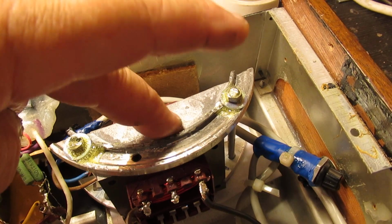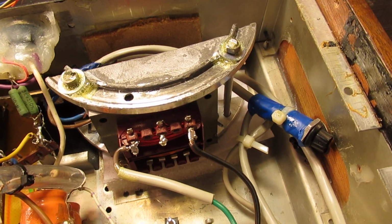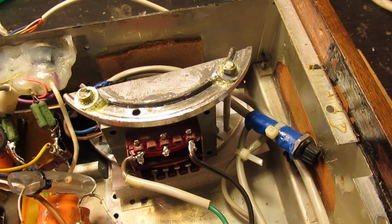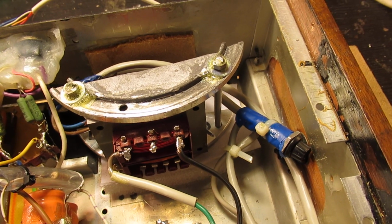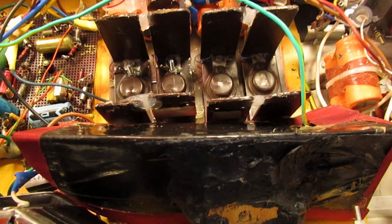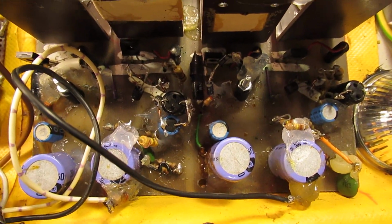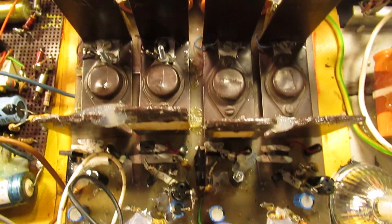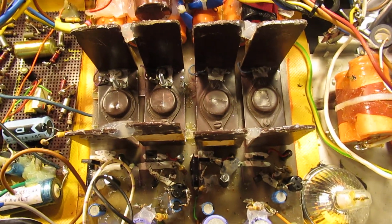And like I told earlier, these are the heat sinks of the transformer. But when you use a more expensive transformer, that's no problem. The core will not get hot, or only a little bit warm anyway. And here you can see this is a kind of hood. Perhaps strange to see, completely isolated tin plate, and the hood covers the input of both the amplifiers to shield it and press the hum level down to the absolute zero.